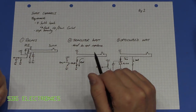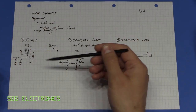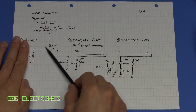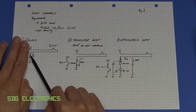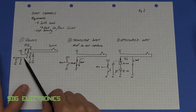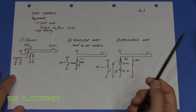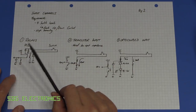I looked at three options for improving immunity. The first is relays, which give the highest immunity since you need quite a lot of current to drive the relay coil. You'd have the switch side on an unregulated 24V or 12V supply, with no chance of a transient being large enough to trigger the coil. The 3.3V logic side into the microcontroller can then use a standard arrangement with a pull-down resistor and a small RC circuit for debouncing. PCB relays are relatively inexpensive but do take up space.